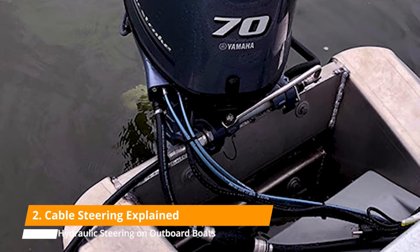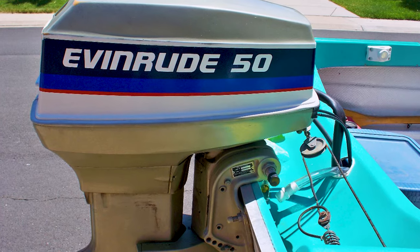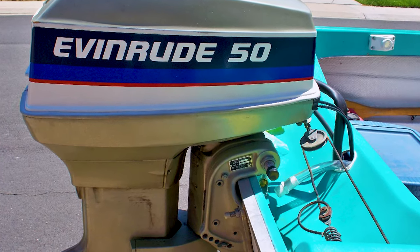The traditional old way of a steering cable — back when outboards were really small and early — may have actually had a cable that looked more like a clothesline with thin line and pulleys, and then graduated to a cable inside a tube which went from the helm back to the engine. As engine horsepower increased they went to a dual cable system because it was much harder to turn the engine when it was under force, because as the prop rotates on an outboard engine it's not only driving you forward but it's trying to twist the engine, and so that feedback or torque comes through the cable back to the helm.